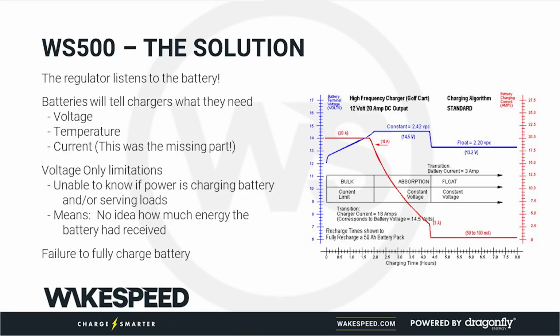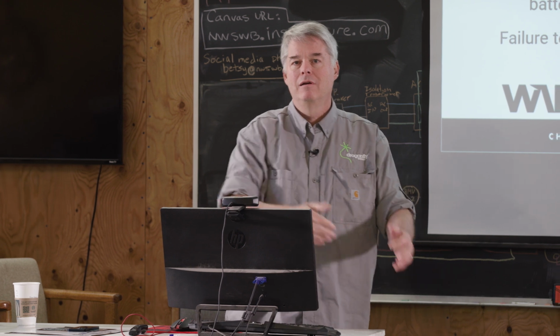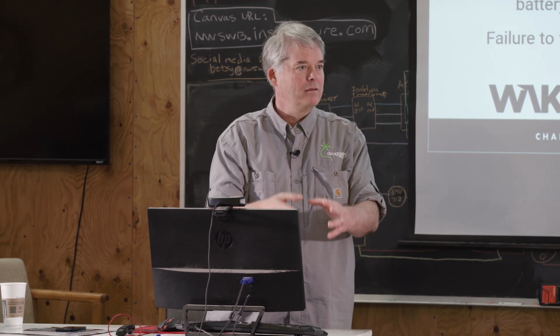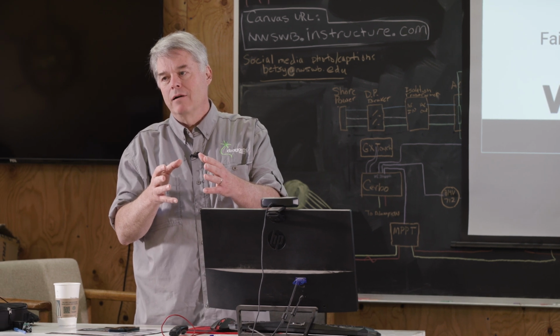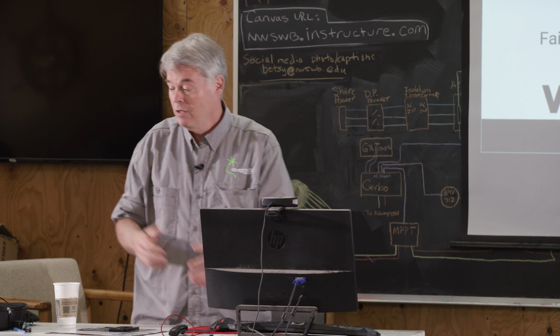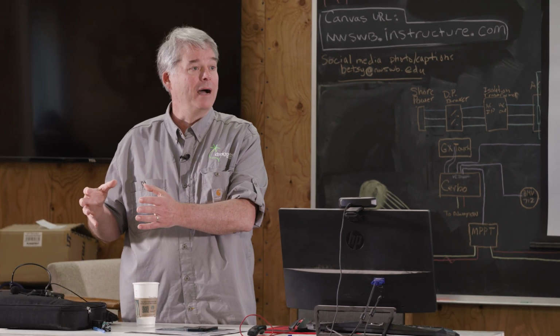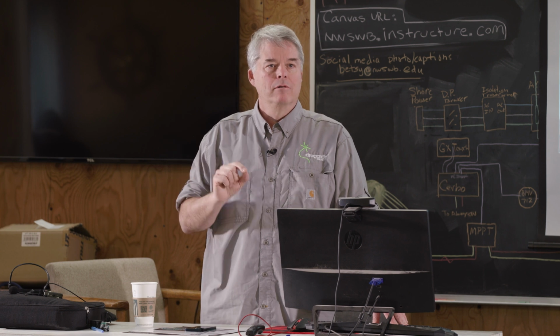So a very rich BMS is able to not only protect your batteries, because they all do that, and communicate out what's going on, because many do that, and maybe also provide a brute force yes or no signal, because some do that, but also say, this is how much. Those are the different levels that a BMS can do. Don't get wrapped around whether it's external or internal. I've seen these in the forums, and I learned a long time ago not to participate in forums.